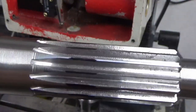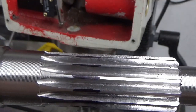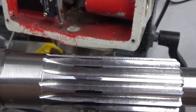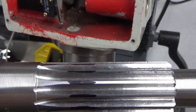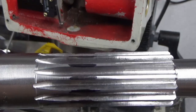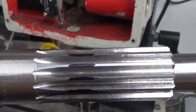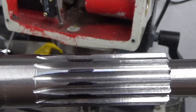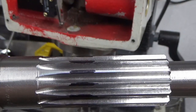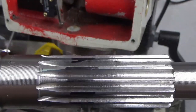So, what's happened there then? The very simple answer to that: the clown that set the dividing head up, whilst he was trying to get 42 holes on a 49 plate, decided that there was 7 holes difference, therefore set the sector arms to a 7 hole gap, where he should have set the sector arms to an 8 hole gap rather than a 7 hole gap.